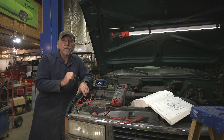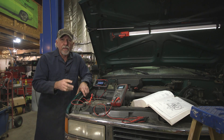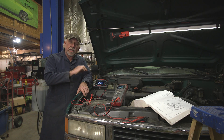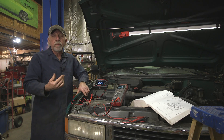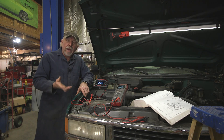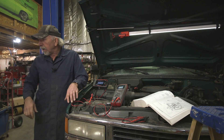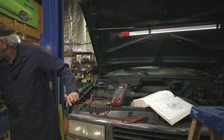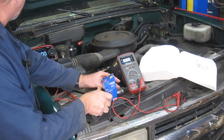Since there are some problems with this particular design with the ignition system, the ignition switch itself sometimes adds to a bad contact. So I thought the logical spot — it's real easy access on this one — we're going to go ahead and do voltage drop at the fuel pump fuse. The meters are already up and going. Let me get some other tools here. I'll need a back probe so I'll be able to go into it.